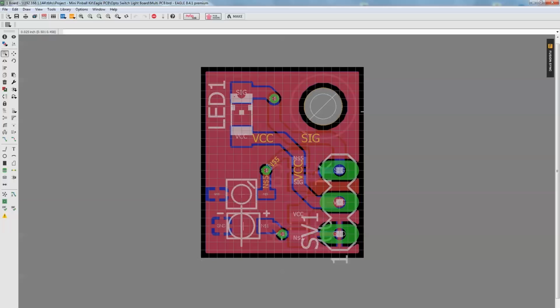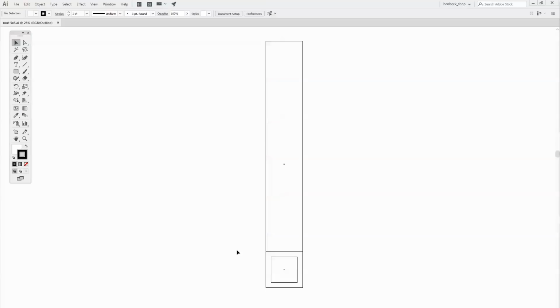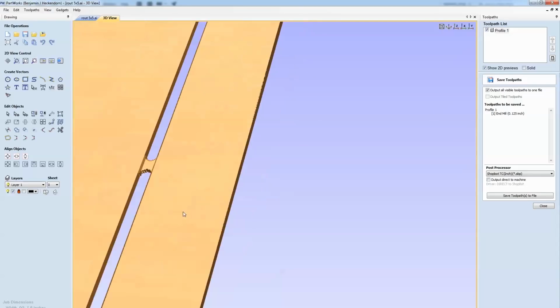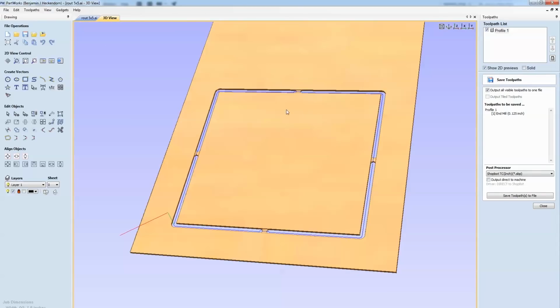So now it's time to do some laser paint. I'm going to go over here into Adobe, and I have a little bit of double-sided copper clad left with paint on both sides. So this represents the area that's free, and then we have mounting holes in the router. So this is the safe cut inside of it. So 5 by 5 I think I can do. And this is what it's going to look like after we cut it out with some nice tabs.